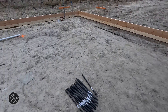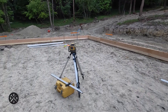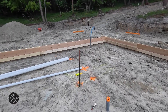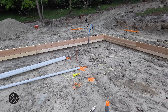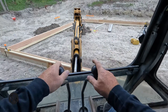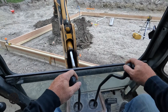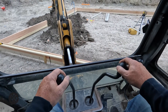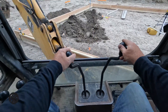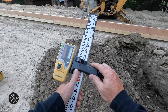Now that I've got that all in and secured, since my stakes showed up the next thing is to brace those and then start plumbing after that. I've got it laid out to give you a little preview. Before I can completely finish the footers and backfill, I have to do plumbing because I have to dig under these footers to get the plumbing done. I can't finalize all the backfilling until I do that. The next video coming out is going to be about digging in the plumbing, so make sure to watch out for that one. Then after that, we'll continue on backfilling the footers and getting the slab ready to go. I hope this video was helpful — thanks for watching guys.